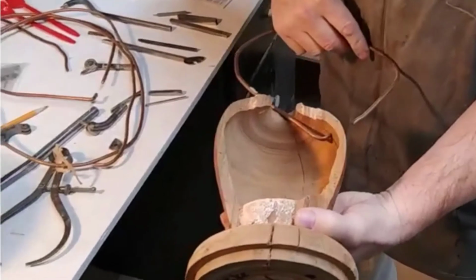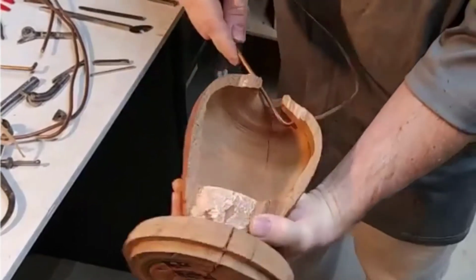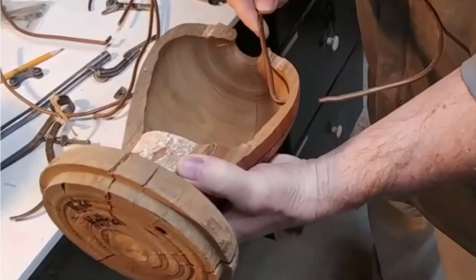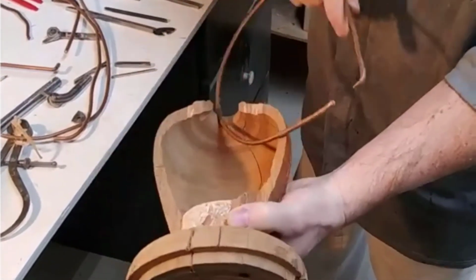Now, the other thing is you have to measure perpendicular to the wall. So for examples here, this piece and this piece, you draw the connection, it's roughly perpendicular to the wall. If you had it arranged such that they were not perpendicular like that, you would get an inaccurate reading. You would be reading a very large thickness when in fact it's relatively small. So that's why you need this flexible geometry. And in fact, you have to flip it around to get to different parts of this piece. So right there, again, you can see the air gap and, by subtraction, you know how thick the wood is. As you go down, you can't get right there. It's not perpendicular, so you'd be getting the wrong answer. And then you'd have to flip it over and use the other end of the caliper. Like that.